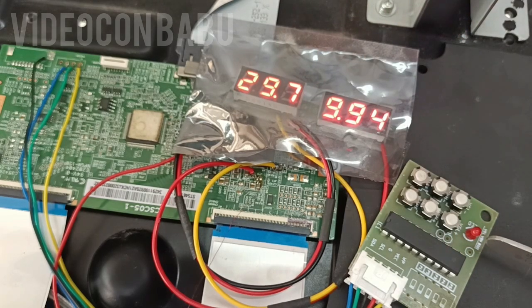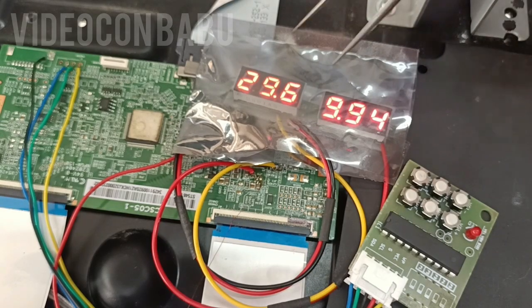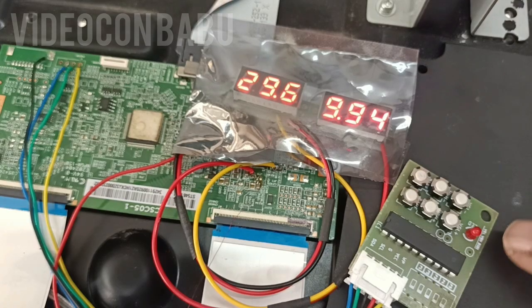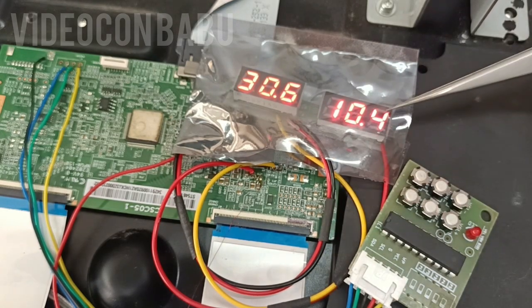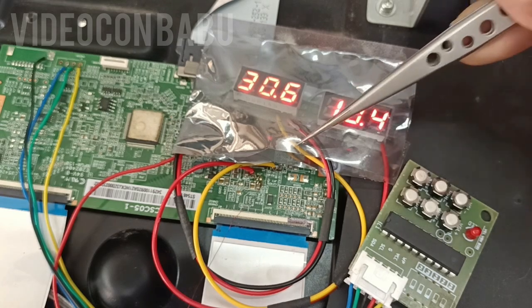See the original voltage. The time delay function will take around 20 to 30 seconds delay. If you watch the LED it will show the timing. Whenever you program the time delay function you want to check the LED blinking — two times, three times, four times, five times like that. See — PMIC booted and the programmed voltage is modified.